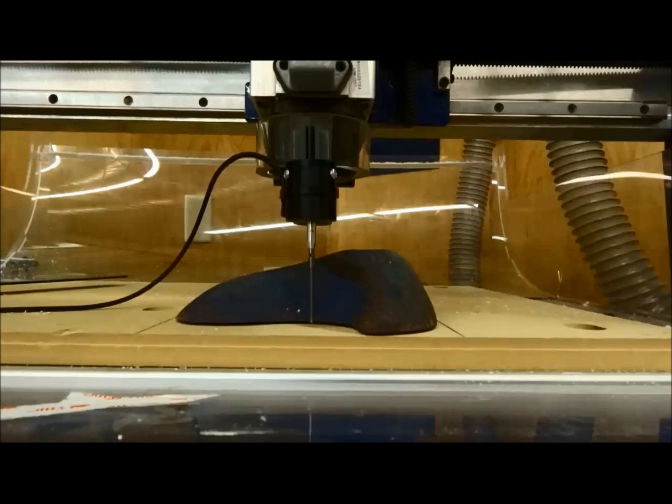The reason for that is, if I zero my Z up above the surface just a little bit, I'm not going to be probing the actual ShopBot spoil board. If I didn't zero this right here, what the ShopBot would be doing is every single time it moves laterally back and forth, it's also going to be moving up and down, hitting that spoil board, which I don't need to record. It'd be all stuff in the Aspire that I'd have to go in and cut out anyways. So I save some time probing, as I set my 0 for my Z just a little bit up above the spoil board, and that's why I use a little bit thicker two-sided tape, so I can achieve this and still get the full probe of my part. And you'll see this again in the 3D model when we bring that in.